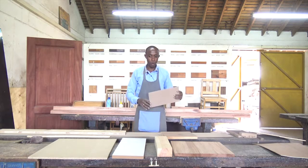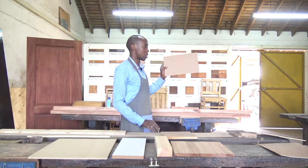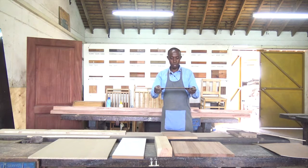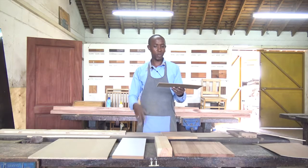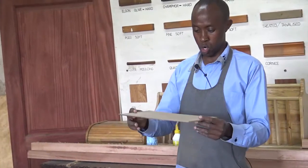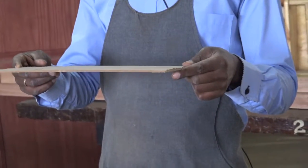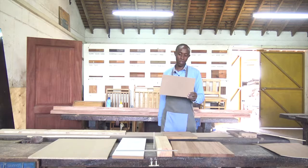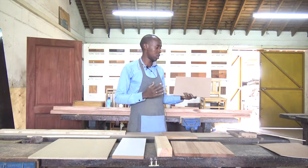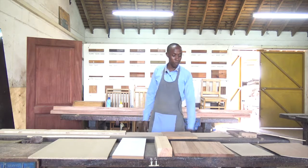If the unit is made of MDF from the inside, it will look MDF. So we don't want to destroy that pattern at the back by using normal plywood. So we have this MDF ply, used at the back side of the unit — especially the TV unit, the wall unit — in almost a similar way as plywood but made of MDF. A very fine groove is made at the back and then it will be fitted. The standard size comes as 8 by 4, that is in feet; in millimeters it is 1220 by 2440. That is a standard size, just similar to every other manufactured board.